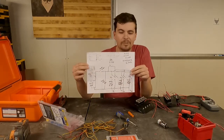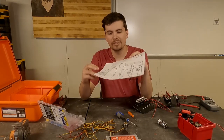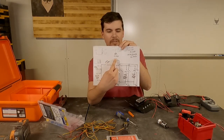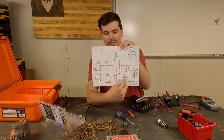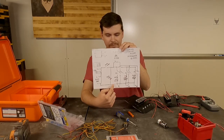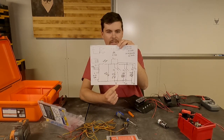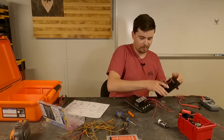I've taken the time now to draw up a basic wiring diagram of what I'm trying to do. Without trying to lose you too much, basically we've got battery in, I'll have a master switch on, as well as a fire button, as well as a pad select switch and a pad select LED that will turn on whatever it turns on. Basically everything completes a circuit. When you turn the pad select switch on, it also activates the out-to-the-pad power.